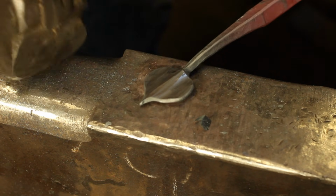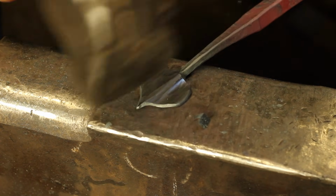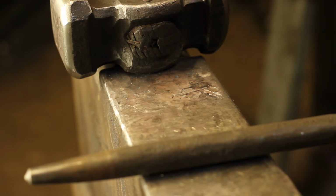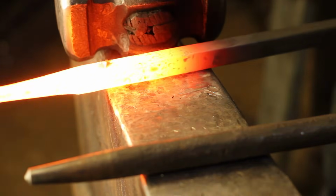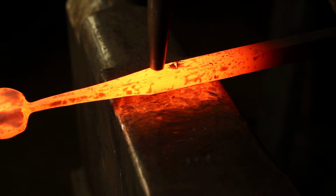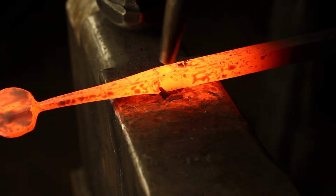This is not meant to be an accurate representation of a leaf, rather an efficient, stylized representation that hopefully will be of aesthetic value. We're going to be using 2 punches to punch a countersunk hole. You can equally just use 1 punch and then finish it off with a drill bit that's the same size as the screw that you're going to be using to mount it.